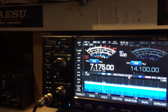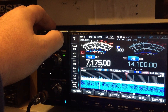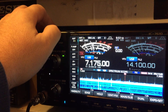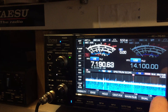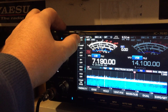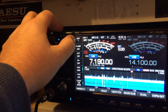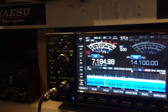So this is the delta loop, 2 feet off the ground — less noise obviously. Switching between end-fed and delta loop. We'll be scanning it about. So looking at the results, the end-fed wins there on receive at the moment. Less noise on the delta loop there, but the precision isn't very good either.